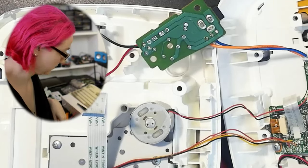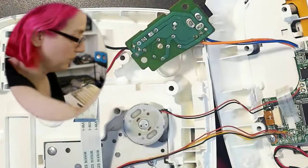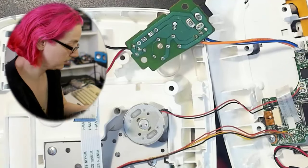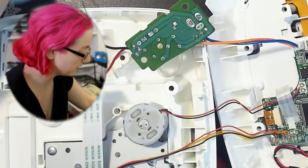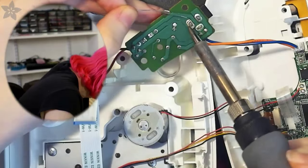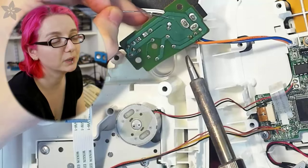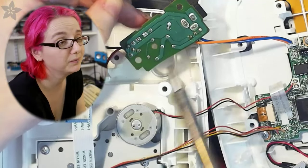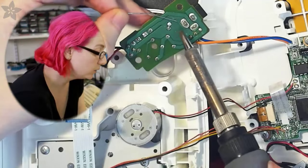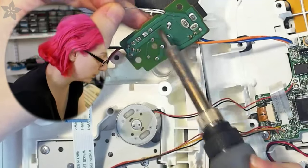and then grab some solder. Pardon me. If you have any soldering skills at all, you can fix this. It's like a $50 label printer. By the way, if you do this, don't be surprised if you damage the PCB even more. These PCBs really aren't meant to be soldered to, in which case you can bridge a wire from the connector to a point.